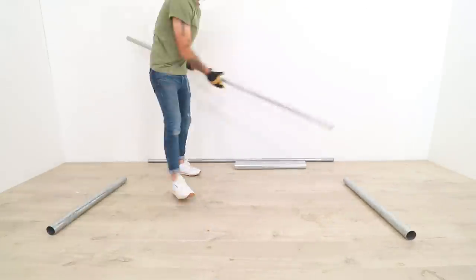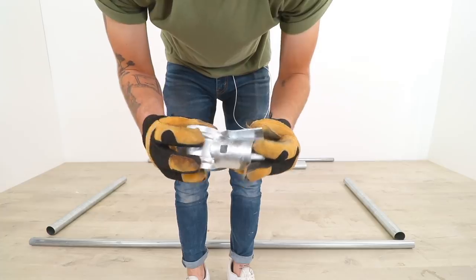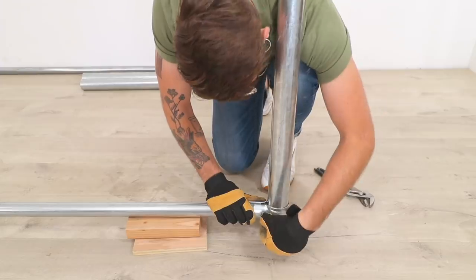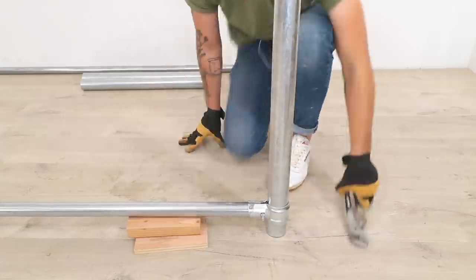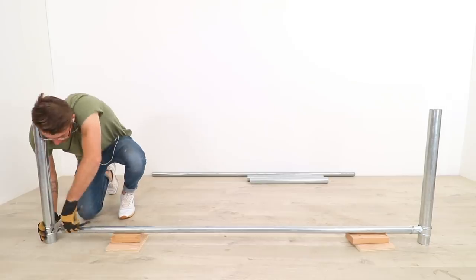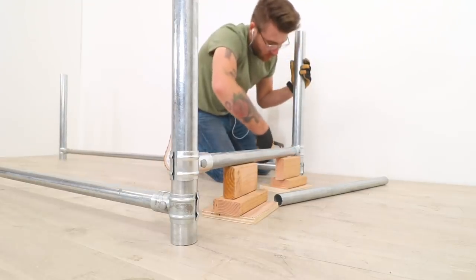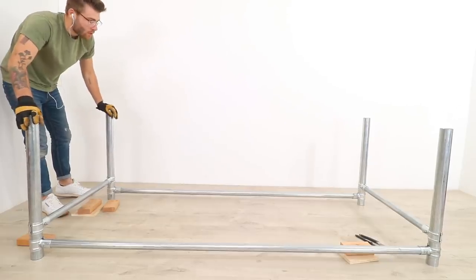I laid out my legs along with a seven-foot stretcher and got my chain-link fence fittings. These tee fittings are specialty parts so you won't find them at Lowe's or Home Depot, but they're easy to find online for a couple bucks a piece. I used a two-by-four and a three-quarter inch piece of plywood as a spacer. The fitting wraps around the pieces in two parts and a carriage bolt locks everything together. I did a dry run before adding any adhesives and found there was still a little bit of wobble between all my pieces.